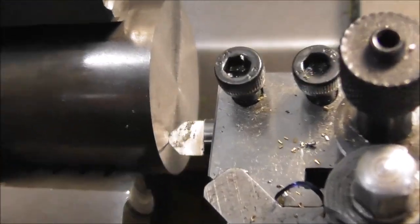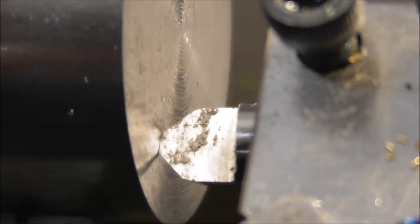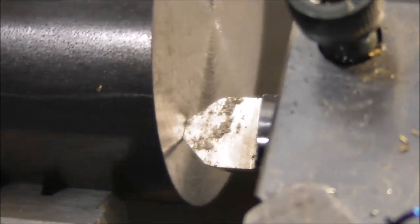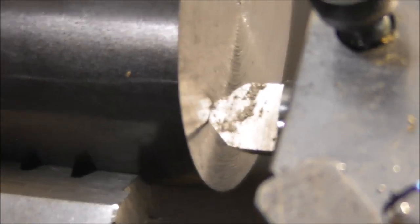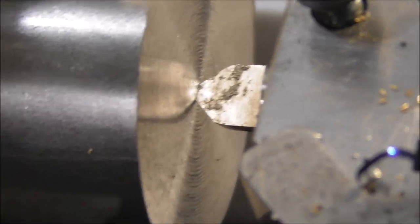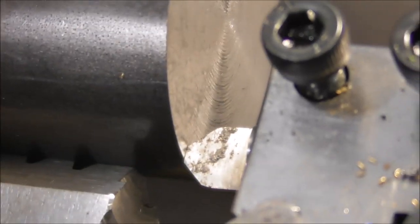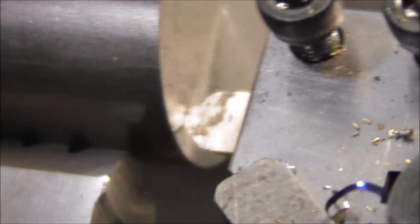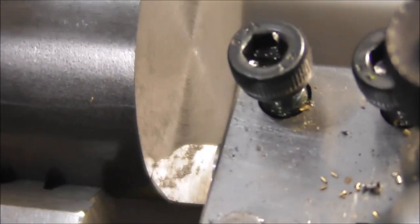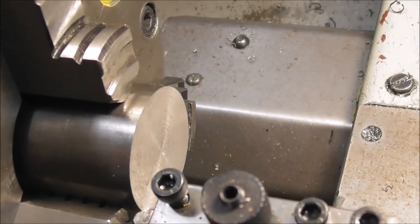Wiper. So the tool is wiping the work. So there's a big flat area of contact with the work. See that surface contacting the work there? You can have a much faster feed rate because the tool is not just generating a flat surface, it's also forming a flat surface. And while the surface may not be as flat as a generated surface, it is concentric